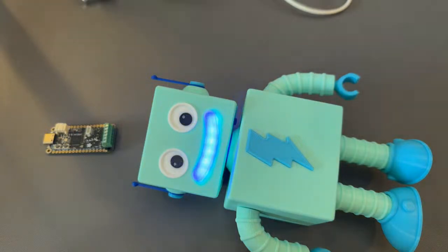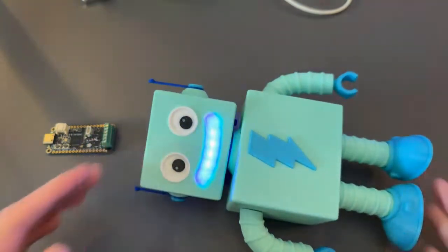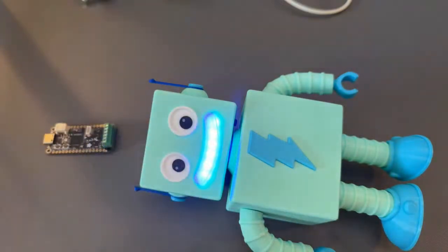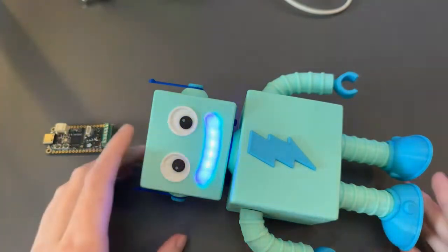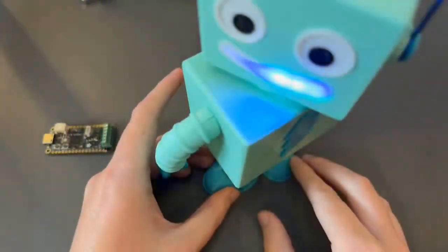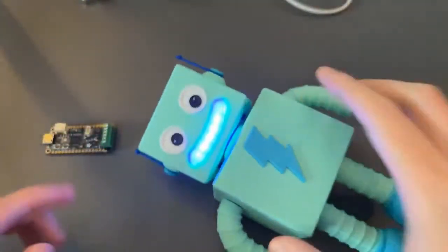Where he was designing it, Adabot really feels alive, randomly moving his head — Ajay has talked about giving a personality to robots. When I was writing the code, I was getting readings from the accelerometer to see when you could definitely tell it was in a certain orientation. So then when the accelerometer reads that it's laid down, the LED animation changes, the movement completely stops, and the audio files also won't play. But then when you stand him back up, he starts right back up.